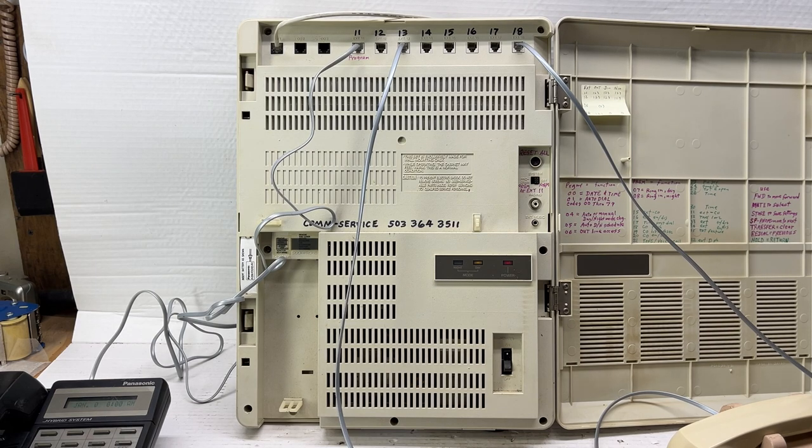This has PBX features built into it, so if you're using the single line phone you can dial the trunk access code 9 and that'll access any of the available three outgoing lines. That can be restricted through programming. If you dial trunk code 81 you will land on line 1, trunk code 82 on line 2, and trunk code 83 would be line 3. If you had the six-line version, trunk code 86 would land you on line number 6.